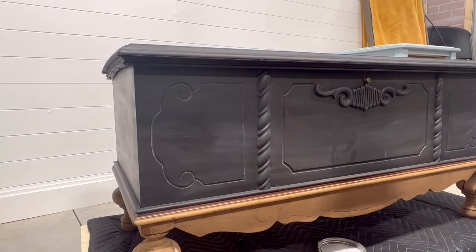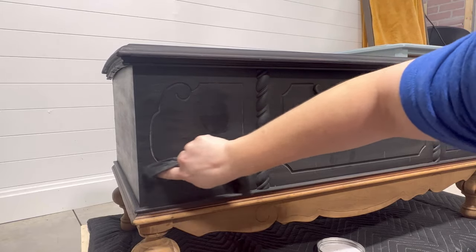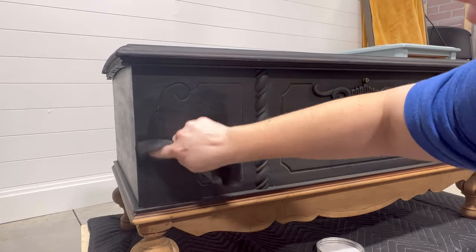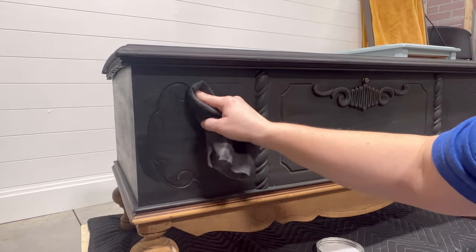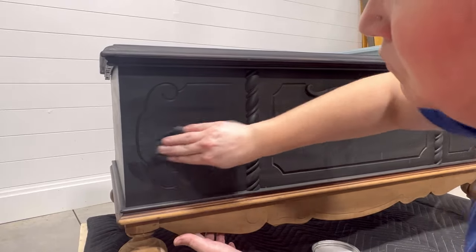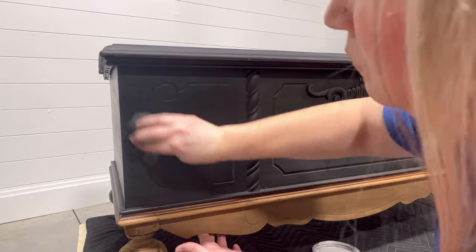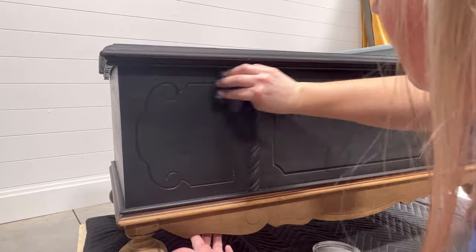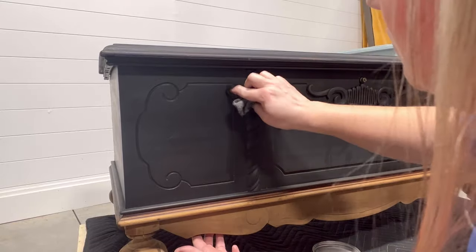Instead of clear wax I came in with black wax from Dixie Bell, because I thought it would give a little more added depth to the black. I'm applying it using an old piece of cloth — actually an old pair of sweatpants from my little boy. I apply it to the rag and rub it over the painted surface, using a circular motion to make sure I have it down in the grain well. Wax can be buffed for extra sheen, but if you like a more matte look, don't buff as much. Do make sure you wipe off any excess, because leaving it heavy in areas can cause it to be sticky or gummy.